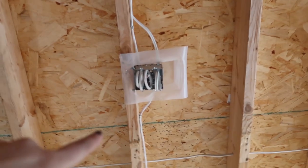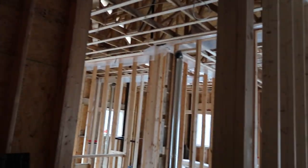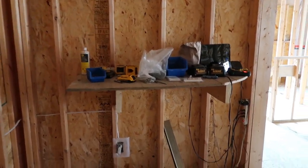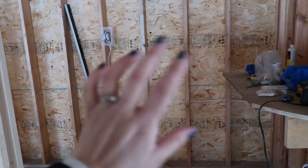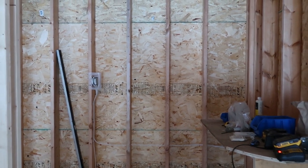We also have a three-way switch running the LEDs at the top of the stairs — flip the switch coming up, the lights come on; come over and flip off the switch on the other side when you leave the room. There's one more switch for two LEDs where there may eventually be a doorway out to a platform in the garage for garbage cans. On that same circuit there are more outlets, including one at locker height in the mud area — I'm hoping to do a locker-type space for kids' backpacks, and I wanted the outlet at a height where you can set your phone on the shelf above it.